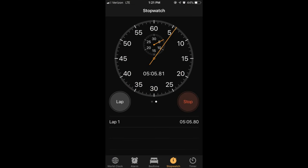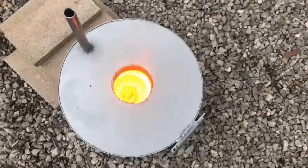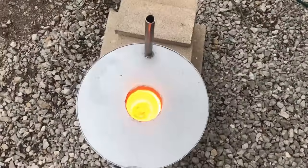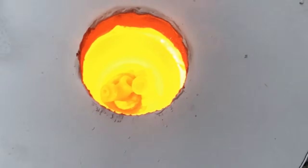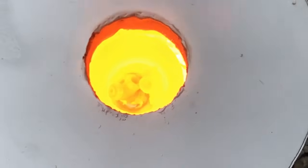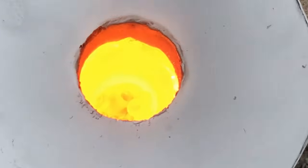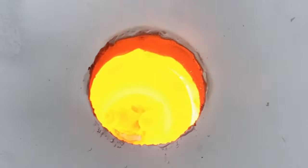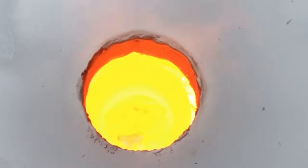Five minutes in, we're already at 2,400 some degrees. Guys, I was wrong — we're about six minutes in and we're already melting cast iron. From a cold start, six minutes to liquid metal. I call it eight minutes because it's been completely melted by then, but that biggest piece melted in around six minutes. The next time I checked the clock was right around eight minutes, and by that point all the metal is completely melted. You can see that clear pool down in there.